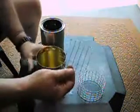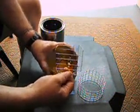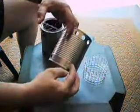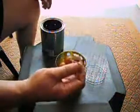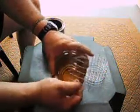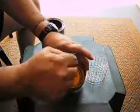The fire grate is used to go in the bottom of the burning chamber. It has four legs which give elevation so that what's in the bottom allows for better airflow into the stove. You do not have to use the fire grate. If you want more wood in the stove for longer burning times, you can remove this and load the stove directly with wood all the way to the bottom.